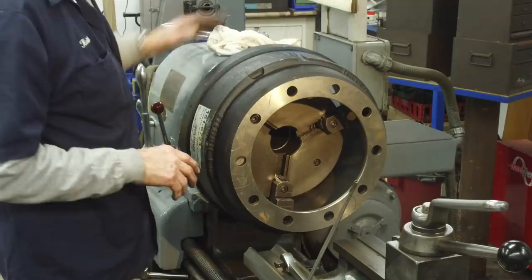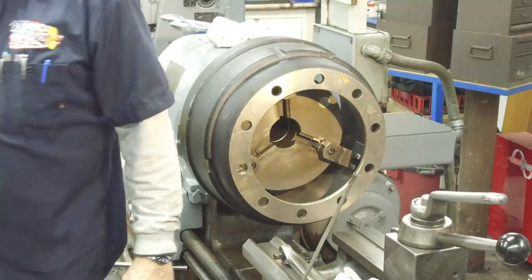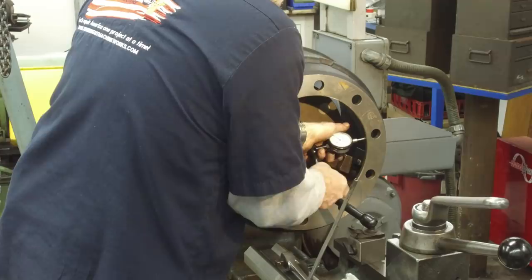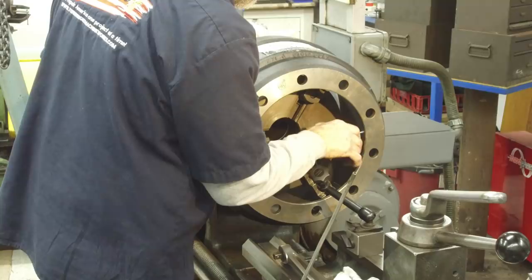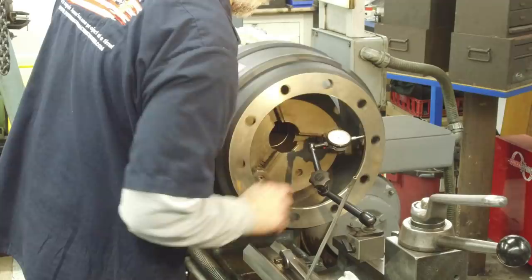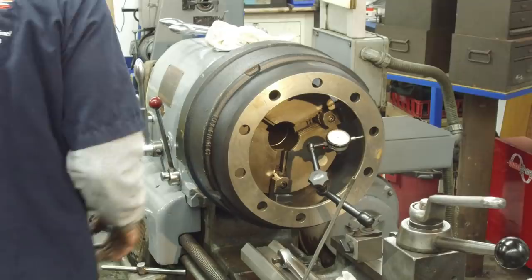There's probably something in the gearbox resonating in the drum sound here. Let's put an indicator on there and see where we're at. I think we can just put one right here. The most important thing is the peripheral runout. And I'm within about 16 thousandths right there. That's our low — 16, right on the money. So we just got to tap it that way a little bit, or out on this backside here — we'll pitch it that way.